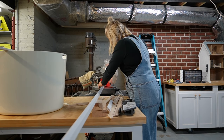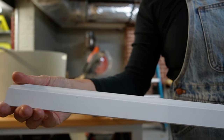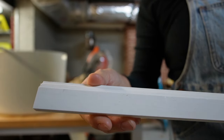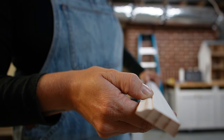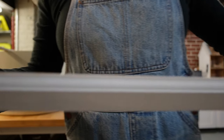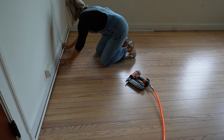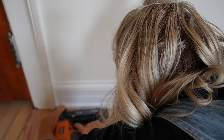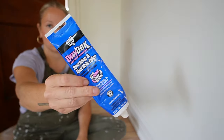The first thing I'm going to do is cut my stop molding for that little gap in the floor. I don't like to use quarter round anymore — once I found stop molding and realized it's more historically correct, it's all I think looks good. It's slimmer and it has that really nice detail that looks great up against the baseboards.